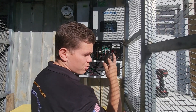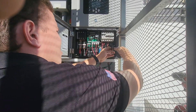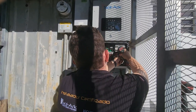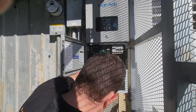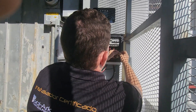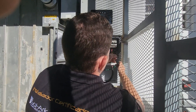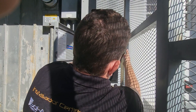We are going to use electrical tape to tape all the cables. These are de-energized as well. Take them out one by one — do not take both cables out at the same time, just for safety. You will have 240V, you don't want those cables touching each other.